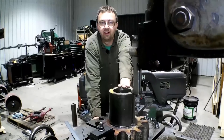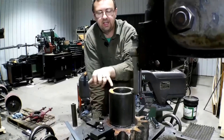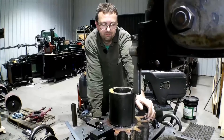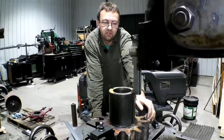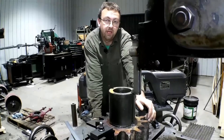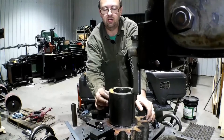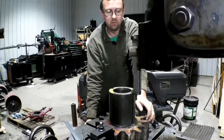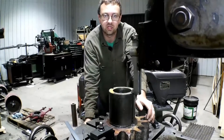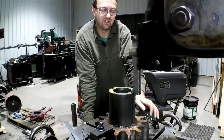I made the decision to do it in the slotter - we're going to cut it externally. I was going to do it in the Bridgeport; there is clearance and I can get in there, but indexing it is going to be the difficult part. So I've got it set up in here and we're going to give it a try. We're trying to get to three-quarter inch width plus a little bit, so we have some float in there because that other piece slides on here - we want a little bit of movement, not much. This is all indicated - everything's indicated - so it should go good. I already set my depth, I'm just about touching. Let's see how it goes.